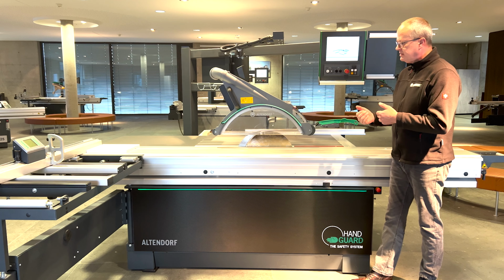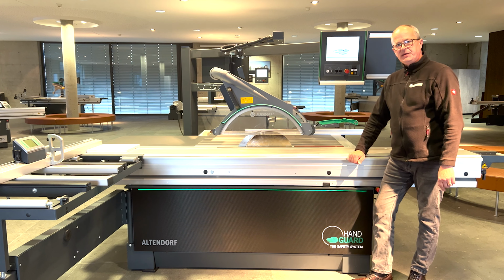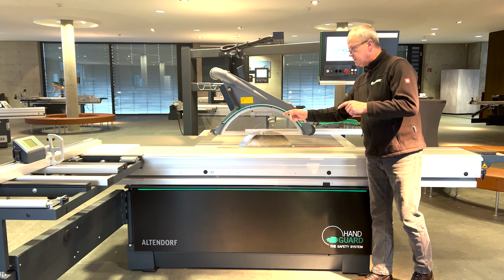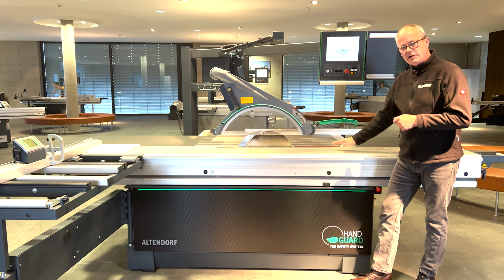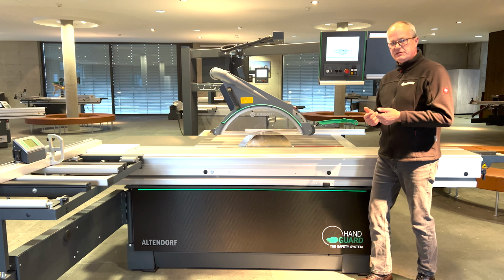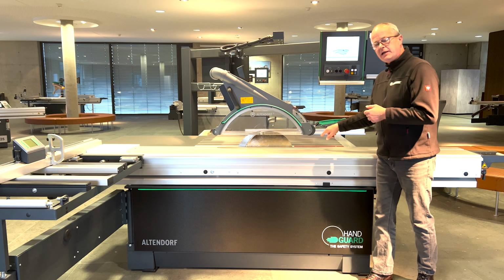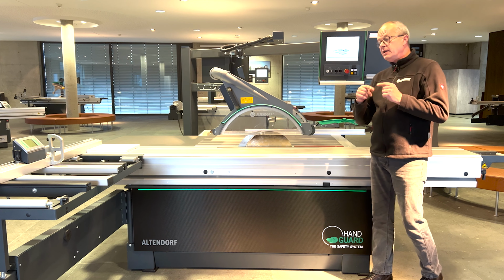Because there are also things like slipping, falling, or doing some fast action around the saw blade that's dangerous. In this case, we can calculate the height of the saw blade depending on the material thickness or whatever, and the feed speed of the worker. So different work speeds, different materials, different workers. Out of these two numbers, we calculate the point when the handguard has to trigger down. That means the distance to the saw blade when it's going down is not every time the same. It could be like this or like that. I will demo this to you.